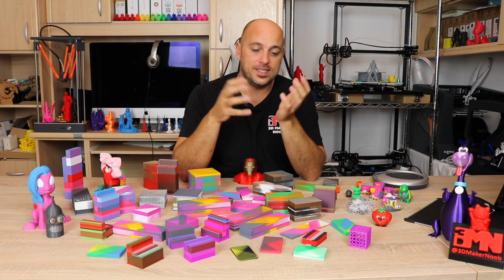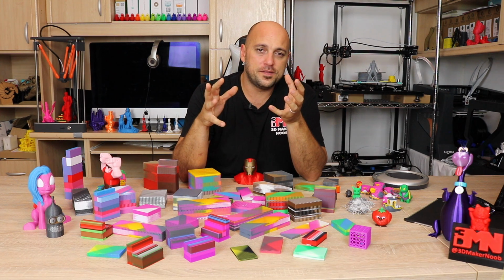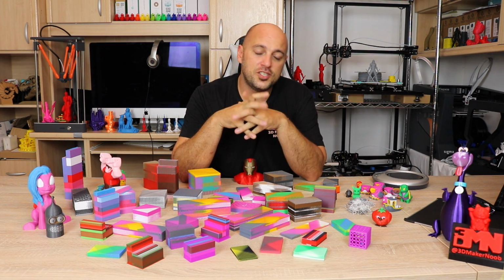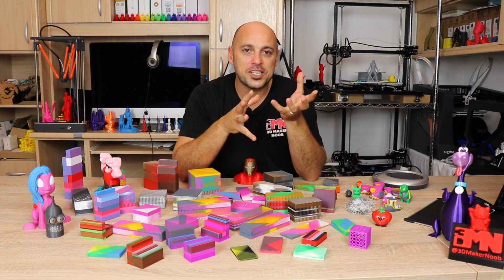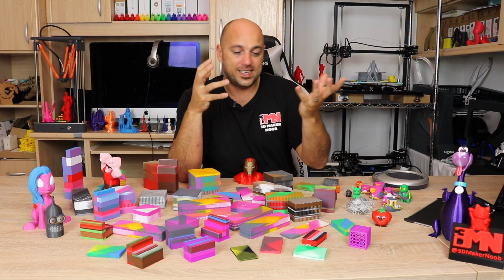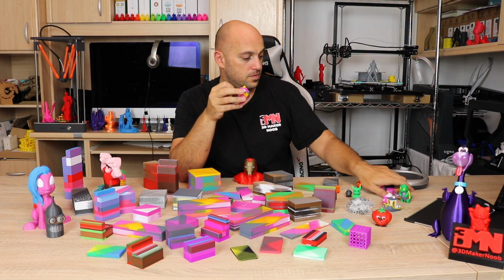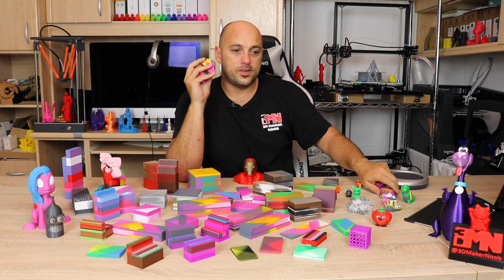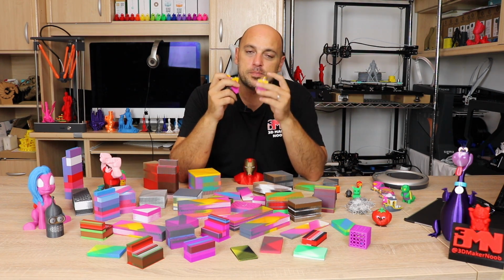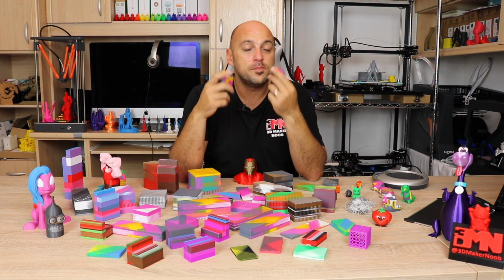have failed prints. And it can be very frustrating because you're expecting a print to finish, you spend about 5, 6, 10 hours waiting for a print to finish that would usually take about an hour in single color, and what happens is it fails. And the example is, well, this parrot right here. I have 1, 2, 3, 4, 5, and I have about 4 more in a box somewhere. What was happening here is the printer was failing all the time. I didn't realize it. I thought it was the Palette Plus, but it was the printer.